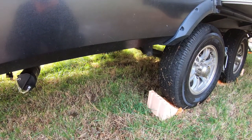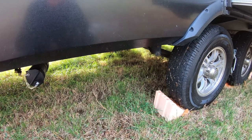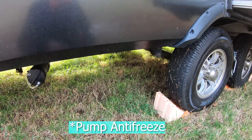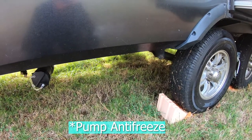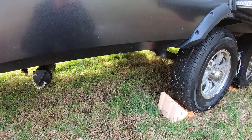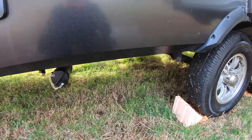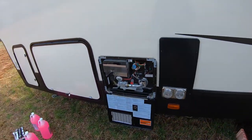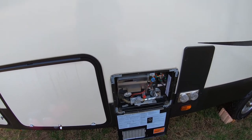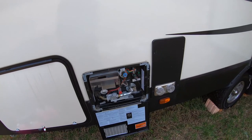It looks like that's about done over here. Having a little bit in there is not going to be a big deal. Technically you could pump a little bit into your fresh water tank too, at least the bottom of it, so you don't have anything freezing on the bottom. But I don't think a little bit of ice inside your fresh water tank is really going to do a whole lot of damage. If you disagree, go ahead and comment below. As long as it's not expanding on those lines inside your RV, that's really the biggest issue — make sure you don't bust any of those lines and have a water leak in the future.